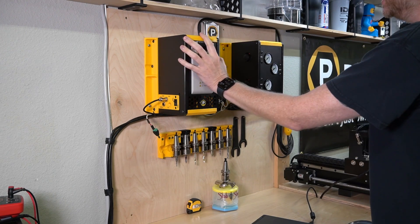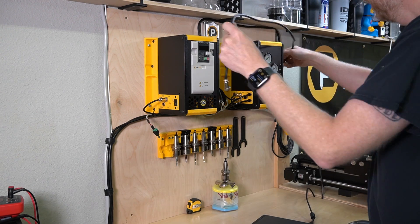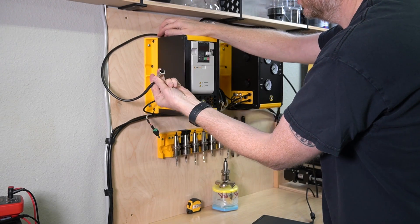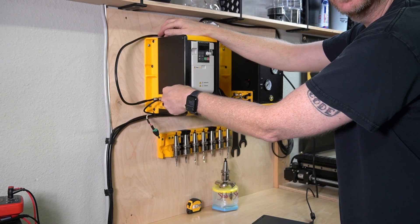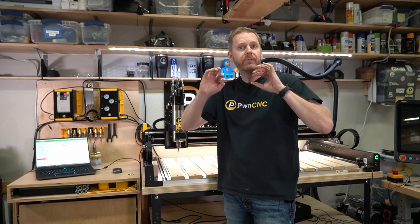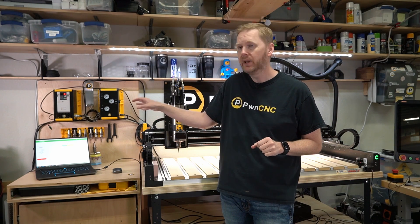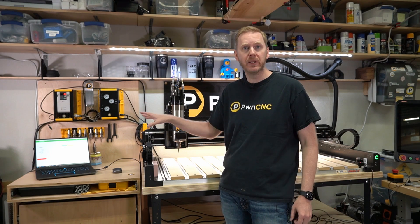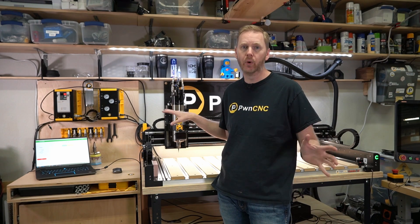So I've got my VFD here. This is an ATC, so I've got a pneumatics enclosure over here, but I'm going to run my control cable up and over and around so that the wires are out of the way, and I'm going to plug it into the PWM port on the left side of the VFD. I've actually finished all of the wiring. Now it's just a matter of configuring Carbide Motion so that it knows it has a spindle and the VFD, and making sure everything is flowing and working correctly.